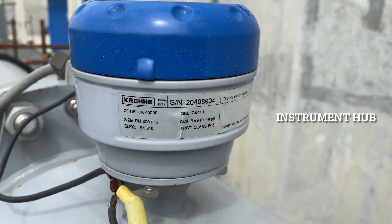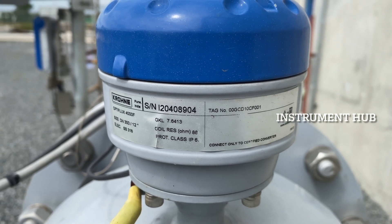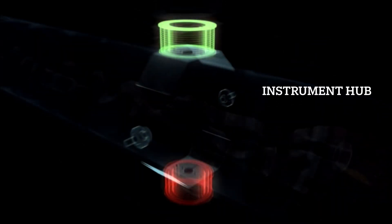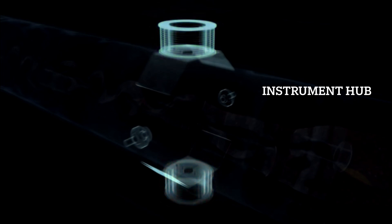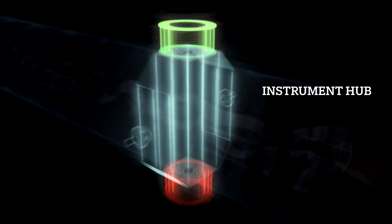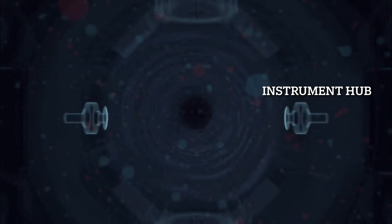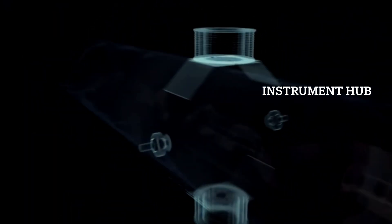You can see this animation video. Two field coils are located inside each electromagnetic flow meter, with the help of what are termed pole shoes. These coils generate a constant magnetic field over the entire cross section of the measuring tube. Two electrodes, which can pick up electrical voltages, are installed at a right angle in the wall of the tube.